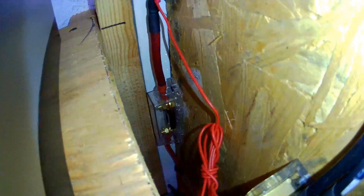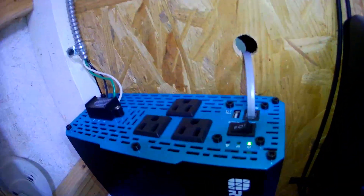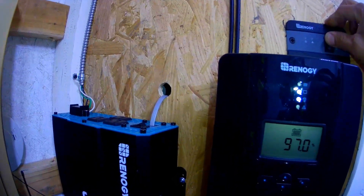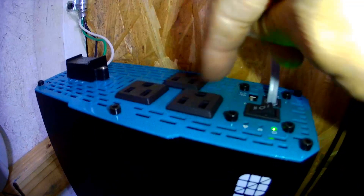The wires keep going down into the battery — this is a 200 amp-hour AGM battery. From there, it goes up through a fuse and a circuit breaker into the inverter. This inverter is 3000 watts, also from Renogy. It's running right now, and I have it connected directly via hard wire. There are also three additional plugs on it, but I chose to hard-wire it.